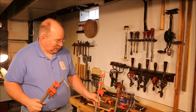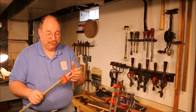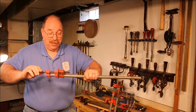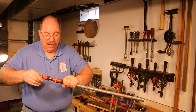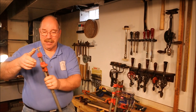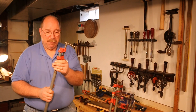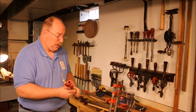Even the sturdier designs have problems. This one is actually made up of two broken clamps — the top part broke on one and the bottom broke on the other. This part failed on one of the cheap sets, so I took an extra jaw from one of the old ones. As I tighten it up, the jaw won't engage — it just slides. The only way I can get it to engage is to clamp down as tightly as I can, and then I can get it to lock. But it doesn't want to stay. Part of the problem is it's against a piece of galvanized pipe — galvanized pipe isn't good for these. You want to use black iron.